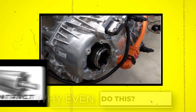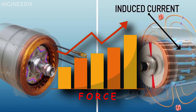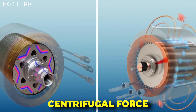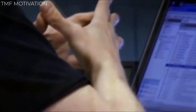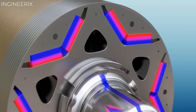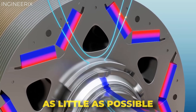Just like how the rotor can contract, it can also expand — not only at elevated temperatures, but also under elevated force, such as when the rotor is spinning at 20,000 RPM. The centrifugal force on the rotor would actually cause it to grow outwards. Elon kind of implied that it would even fly apart if it wasn't being held together by the wrap. But the reason we don't want the rotor to expand is because we want to keep the distance between the rotor and the stator as little as physically possible.